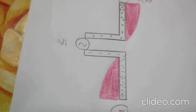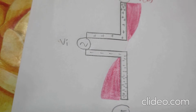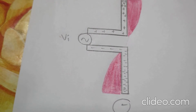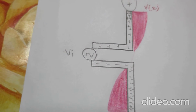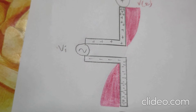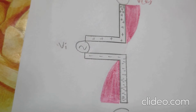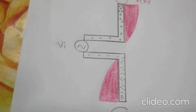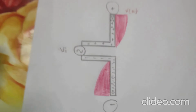Following Ampere's law, current in the antenna produces a magnetic field. A transmitting half-wave dipole showing the voltage and current due to the standing wave on the antenna is shown. As the current varies, the magnetic field varies in magnitude and direction. The strength of the magnetic field is proportional to the amplitude of the current standing wave, while the strength of the electric field is proportional to the amplitude of the voltage standing wave.